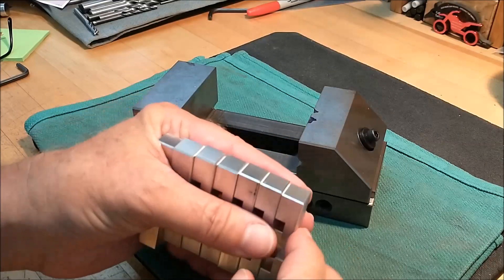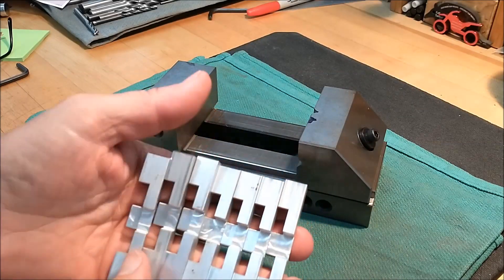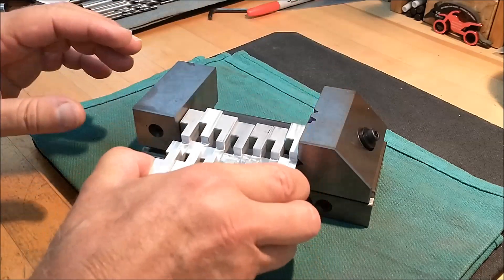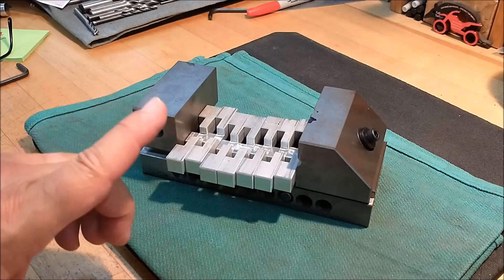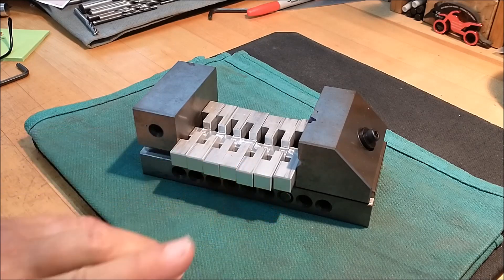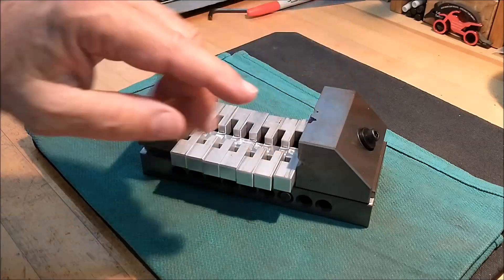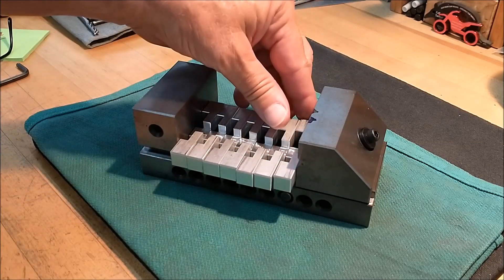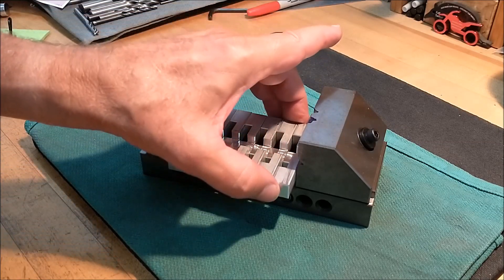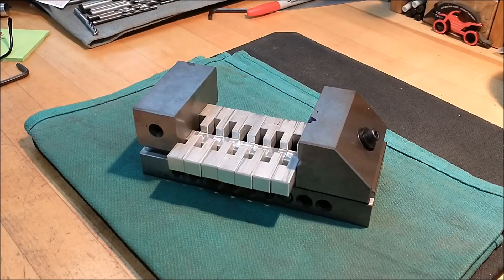The challenge this morning is to put a chamfer on the ends of all of these pieces. It could be a chamfer, it could be a radius, it could be an angle — it could be whatever you want it to be. What I'm going to do is use a second vise and put all of these pieces in this vise. The challenge you're going to encounter at this point is lining up all the ends. You can do that many different ways. I've seen very commonly a second vise put on its side on spacer blocks, allowing the pieces to fall using gravity against the surface plate or table — and that will give you the projection that you're looking for. I'm going to show you a different technique that you may not have thought of.